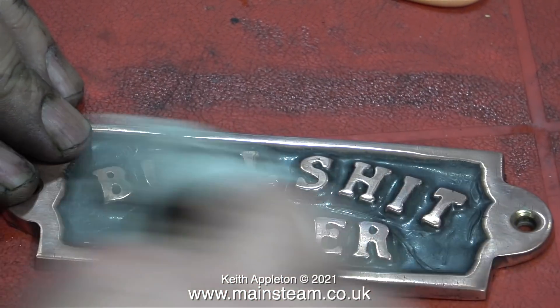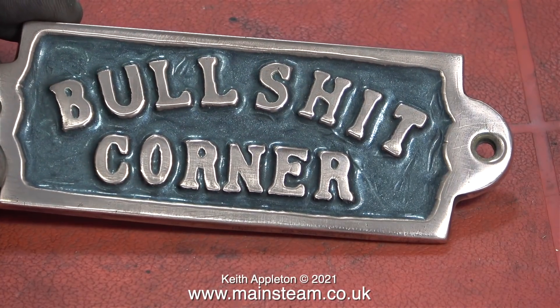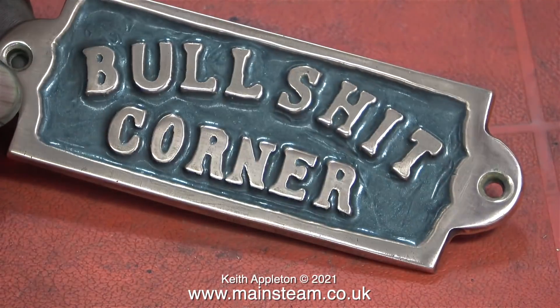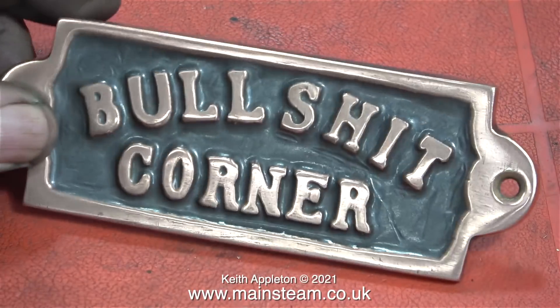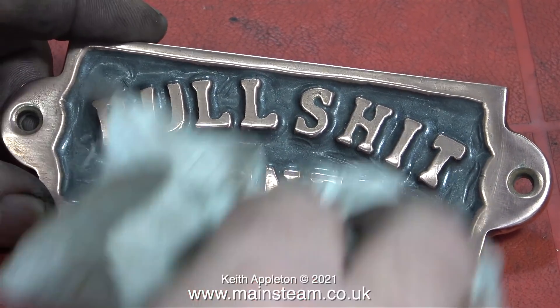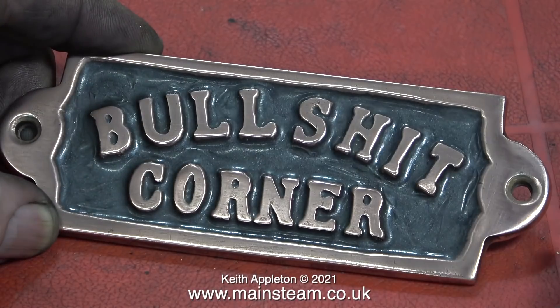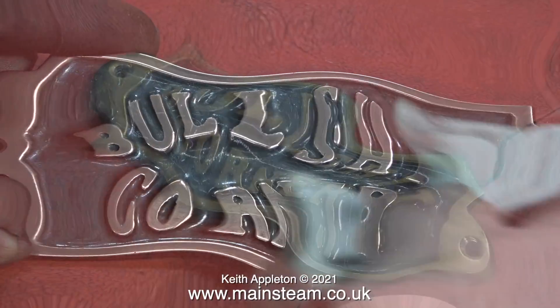In this clip I'm finishing the cleanup process using some Brasso wadding, followed by buffing it up with a cotton cloth. And this is what it looks like — the surface isn't perfect because I didn't make the surface perfect before I plated it. On the next part I'm going to really polish it up before I even start. It will still need manual cleaning though — it will not come out of the electrolyte looking like this. As I mentioned, there are commercial compounds you can add to the electrolyte to give a shiny finish and I'm looking into it.